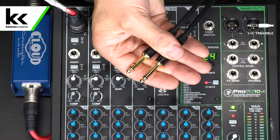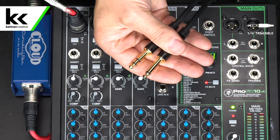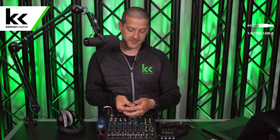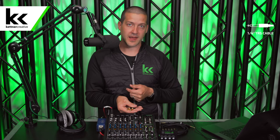The second connector is a balanced quarter-inch cable. You can see it has three parts: the tip, the ring, and the sleeve — so it's called a TRS cable, or tip-ring-sleeve, or a balanced quarter-inch cable. This cable works for two different purposes. It can carry an unbalanced stereo signal — so if you're using headphones and need left, right, and ground for up to 15 feet, this works great. It can also carry a balanced mono signal by sending two versions of the signal, with the second phase-inverted. At the destination, it gets re-flipped, canceling out noise on the cable. It can carry an unbalanced stereo signal or a balanced mono signal — very different uses, but the same cable.